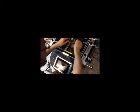This wire's purpose is for measuring the bottom heat that's coming out of your bottom jet, so you can make sure you're not overheating the bottom of your board. What you want to do is bend your tip so that it's basically hanging in the lower nozzle area. You want to keep it up a little bit so it's not reading the temperature down inside the unit. What we're looking for is more of an actual temperature. As you can see, it's about a quarter inch down in there in the center of the nozzle. That'll allow us to get a temperature reading off our lower nozzle during our profile, so that we know our board is getting the proper heat to the bottom of the board.